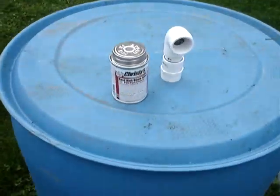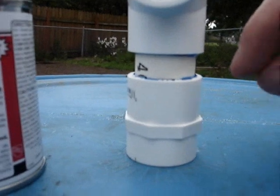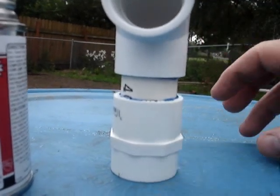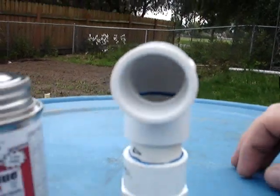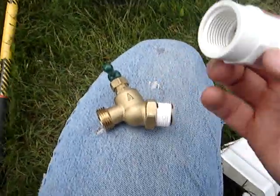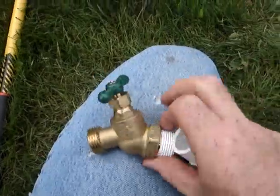I'm going to go ahead and glue this together. I'm using Christie's Red Hot Blue Glue — it's a one-stage PVC glue, so you don't have to worry about the primer and then the glue. When you're doing this, try not to put on so much glue that you get big bubbles leaking out and drips down the side. That glue really burns right into the PVC and you can cause weak spots in your pipe if you have too much excess. Just a real thin line of glue is all you want. It's not a big deal if you get a small drip, just try to keep it under control. I'm also going to attach this threaded piece to my hose bib before I put it on the pipe, so that when I glue this piece to the pipe, I'll have it standing up straight.